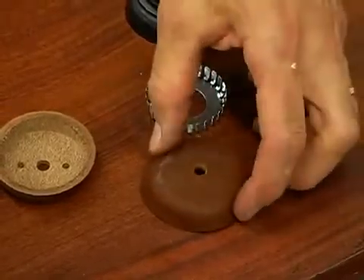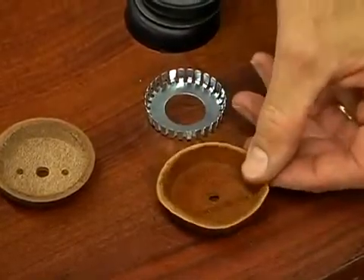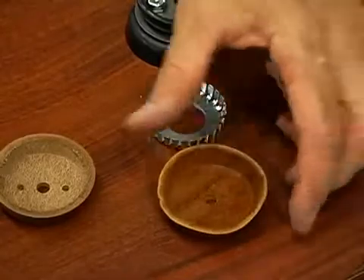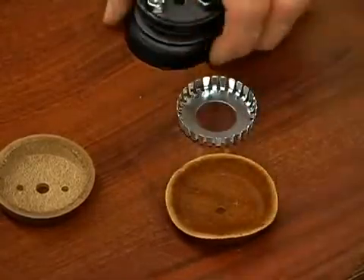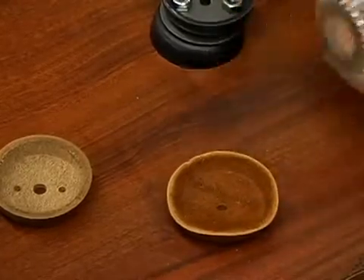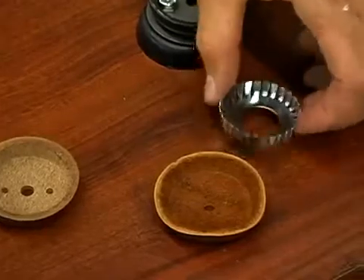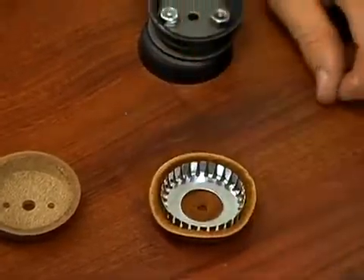Number 21-1 Soft Leather Piston. It has low friction, it's tough and durable, and has excellent chemical resistance. To maintain it, soak it in motor oil. It's not recommended for water-based materials. Add a number 222-2 expander in front of the leather piston if you are experiencing leakage or blow-by.